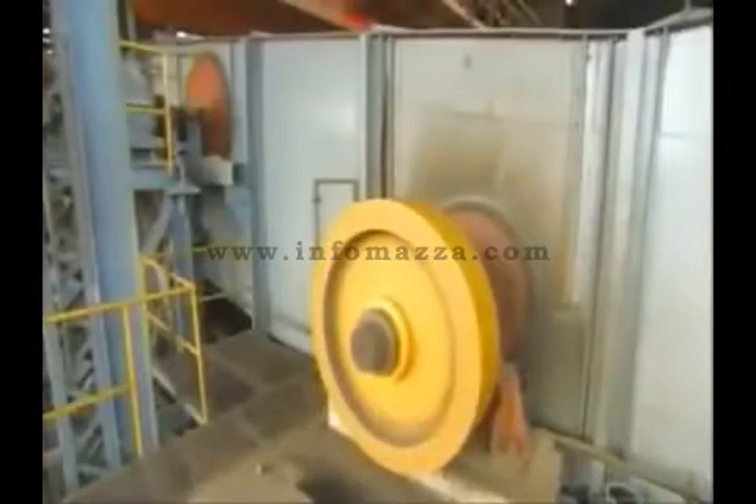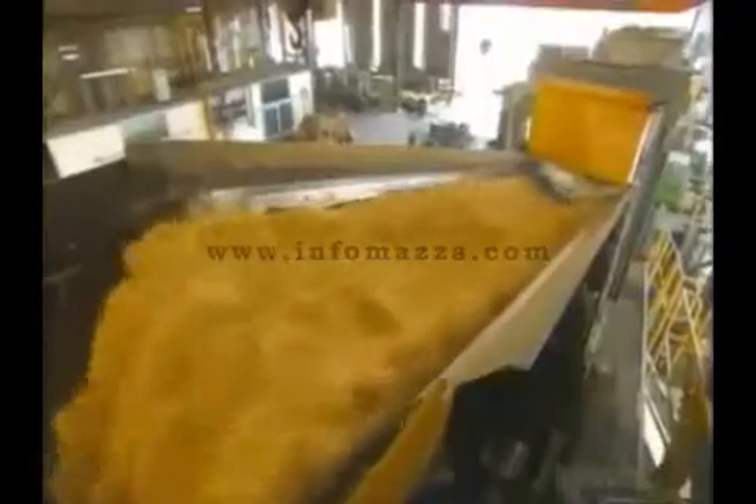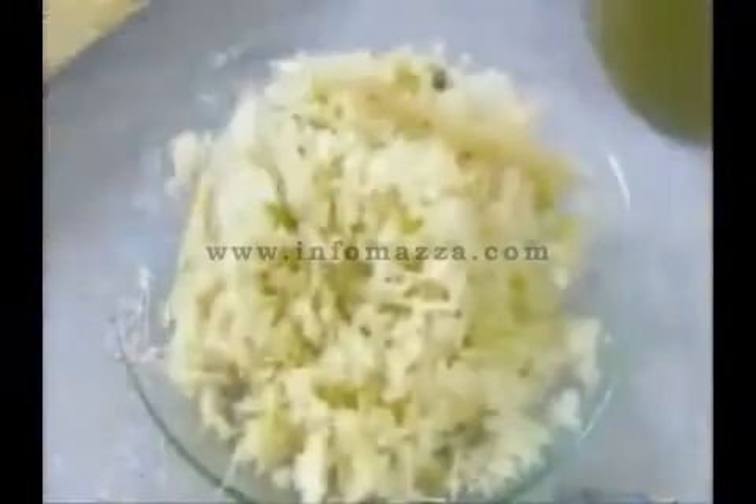But first, the cane's hard structure is broken down inside a crusher, where rotating hammers break the cane into small pieces. A conveyor loads it into a milling tandem designed to extract the sweet juice from the crushed cane. In this milling tandem, the cane passes through a series of five or more consecutive mills.